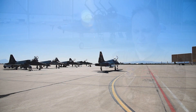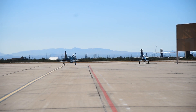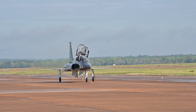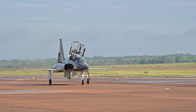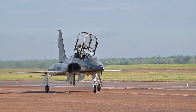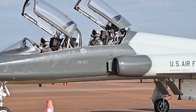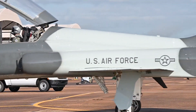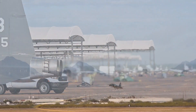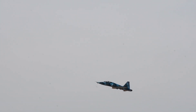The T-38's wings were originally designed to withstand 7.33G loads and for a fatigue life of 4,000 flight hours. This proved sufficient for the majority of the training syllabus, but was a major limiting factor when the aircraft was used for aggressive dogfighting-style manoeuvring. Incidents of wingtips separating mid-flight were reported, and Northrop resolved this via the installation of new wings with thickened skins.